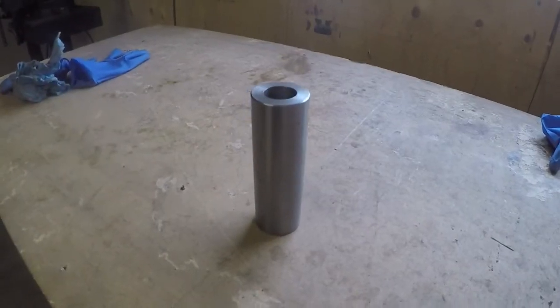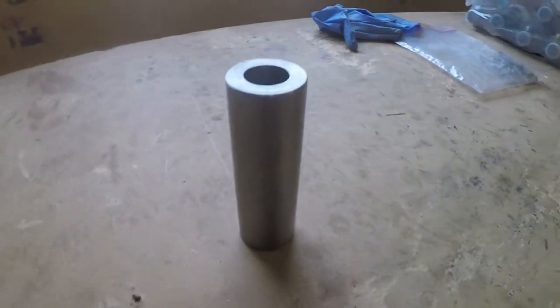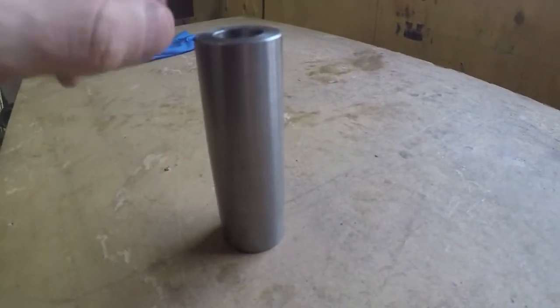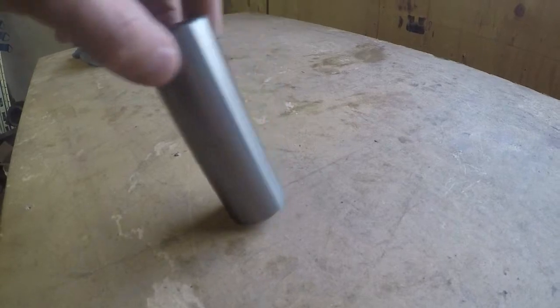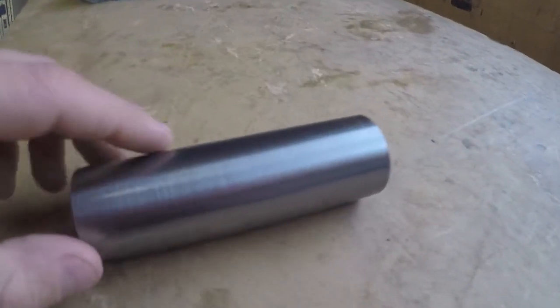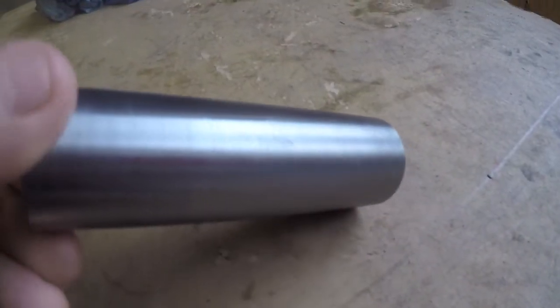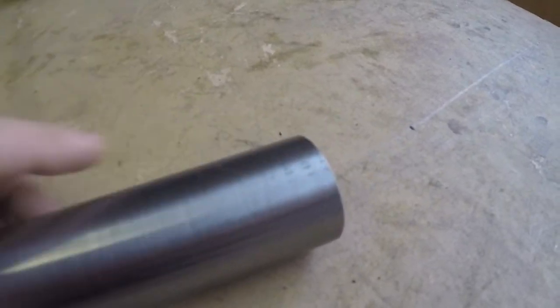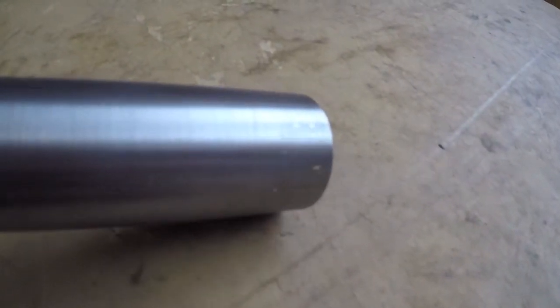And this is the finished result. Got it down to final diameter. Drilled a 3/4 hole out in the center of it. And the finish on it actually turned out quite nice in the end. It has some marks in it from the jaws, but they won't be a problem. So that is the end of the video for today, and I will see you guys next time.